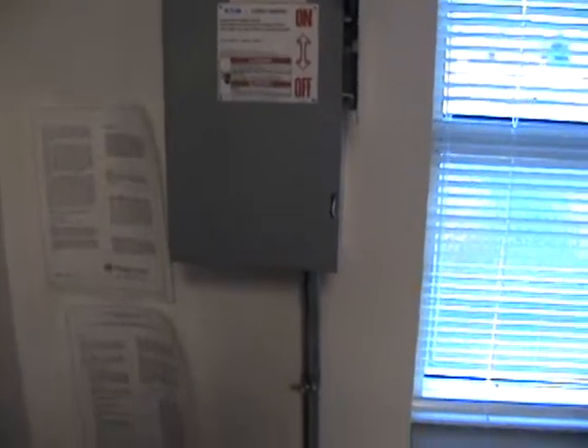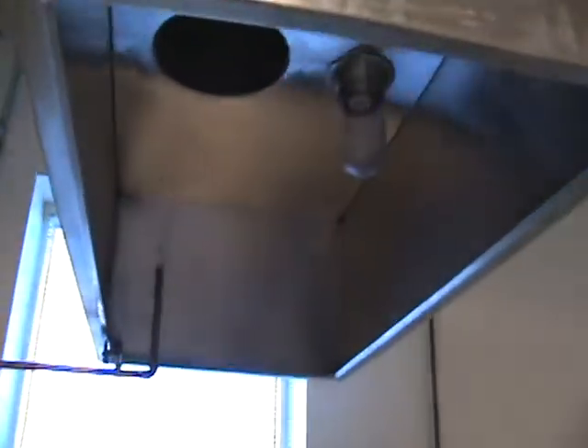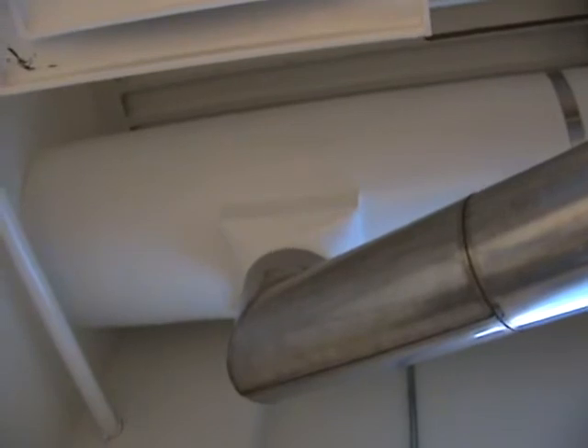Here are the cold water feeds coming into the back. It takes a substantial amount of power to run these things, so you'll have to make sure you have enough power. You also have to be able to drain the autoclave — there's a drain back here. And you'll need to vent these things. We've got a large vent with a light, and it's venting into our separate fume hood ventilating system that runs the entire length of the incubator.